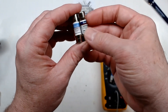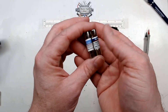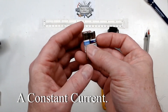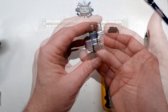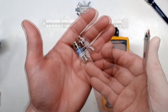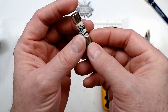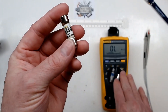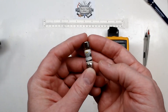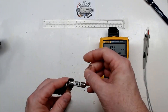I thought this might be a good comparison, even though I don't have the best equipment for testing fuses. I can't measure AC cycles, but I'm simply going to push DC current through them and see how far above 400 milliamps they can go. I'm sure they'll take over an amp on steady current since they're made to handle quick peaks, but they should eventually heat up and fail when over-current. To verify my test setup, I'm first testing an FN QR1 fuse I had on hand.